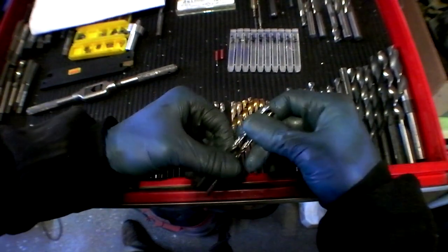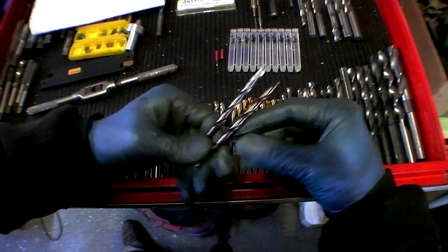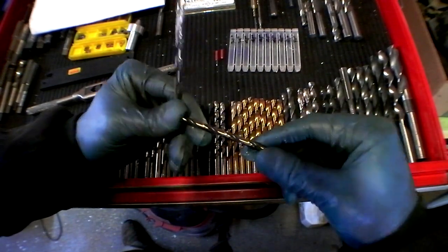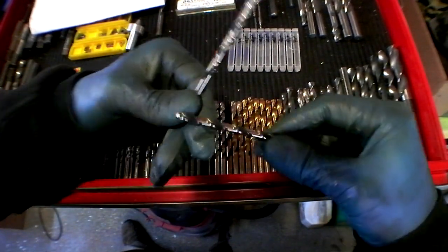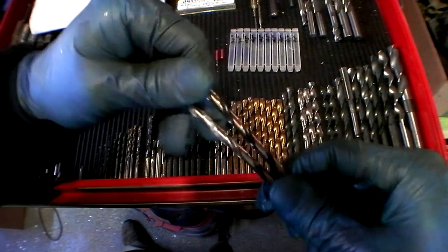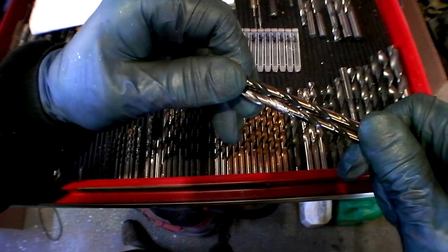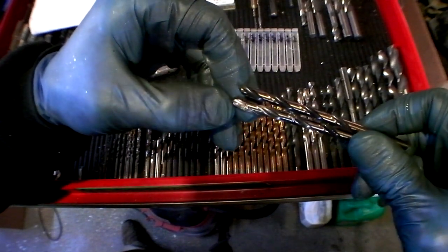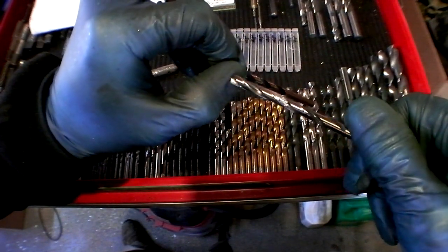Lucky for me Fastenal is five minutes away. However, they did not have any parabolic drill bits in stock. So I just got these — they call them black and gold drill bits. They're just typical center-cutting, classical drill bits. Anyway, I tried one manually, and this is a classic example of what chip loading or chip welding looks like. You can see this bottom one is completely gummed up with chips.